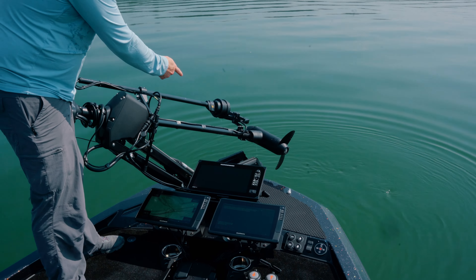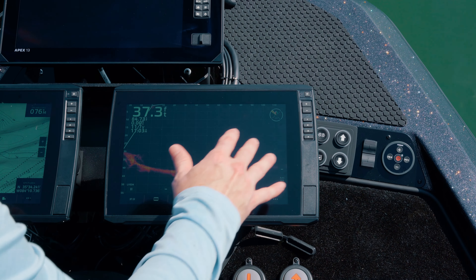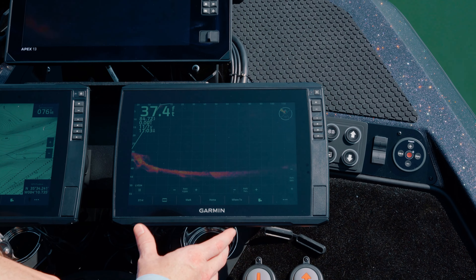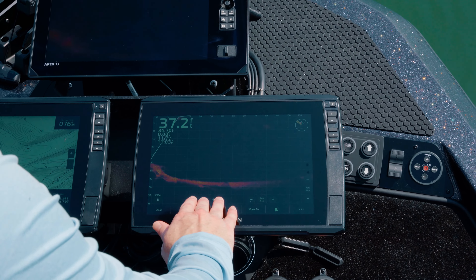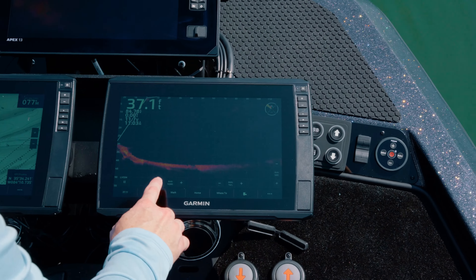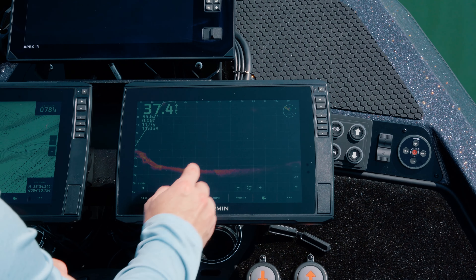Previous LiveScope versions like the LVS32 required more of this step and it was a little bit more intense. It's mainly just getting the compass calibrated so that it knows which auto zone you have it in — do you have it in forward or down? This calibration success is going to allow us to quickly clip and turn. If we want to put it in perspective mode, it'll allow us to do that. It'll allow us to put it in forward mode, down mode, and do that all in auto — it'll detect when you do that. When you pull up the trolling motor, we've got it set in forward mode right now. The perspective mode bracket comes with the LiveScope Plus these days, the LVS34 — you no longer have to buy that as an accessory, it comes with it. But if you're in shallow water, say 11 foot or less, you can turn and twist that LiveScope and put it in perspective mode. Perspective mode really does best in shallow water.